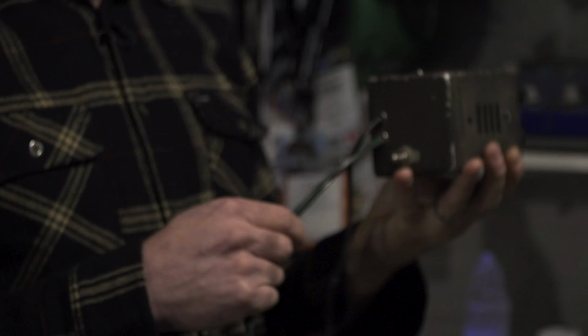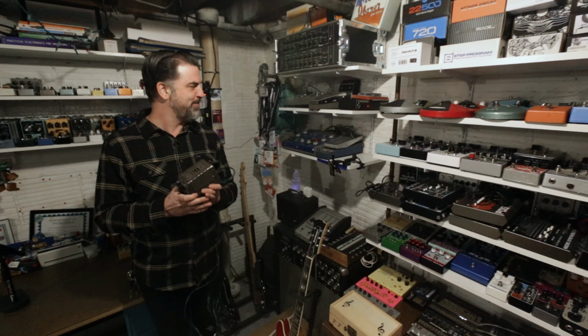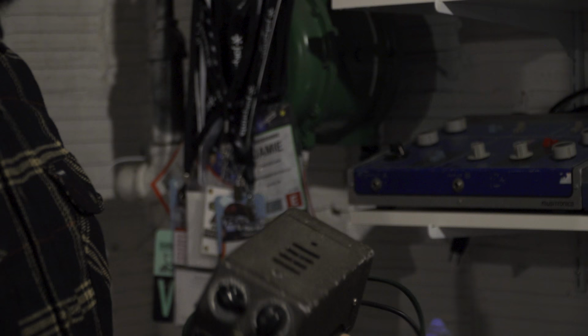And the little oil can inside, I couldn't get it open to fill it with fluid again, so I drilled a little hole inside and then covered it with copper tape, and then the Windex that I put in it dried up. But it basically just shakes a little canister of conductive fluid around a wire, and it grounds the signal out. That's how it makes tremolo. This just adjusts how the canister shakes.